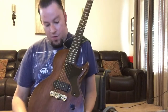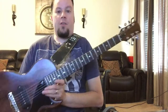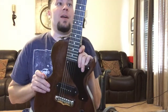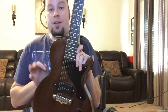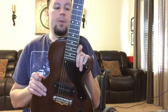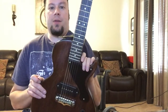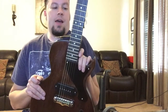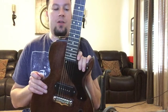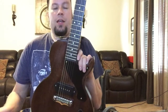But it still looks really cool. And if you remember from my part 1 video, I was going to do this in a worn white finish. Well, obviously, this is not worn white. I tried to use a wood tone finishing kit. I had used one on my previous build with great success, but this time I didn't have much success, mainly because of the sanding sealer. Wood tone says you don't want any sanding sealer because it will react badly. My last kit had sealer, I sanded it off, and had no problem.